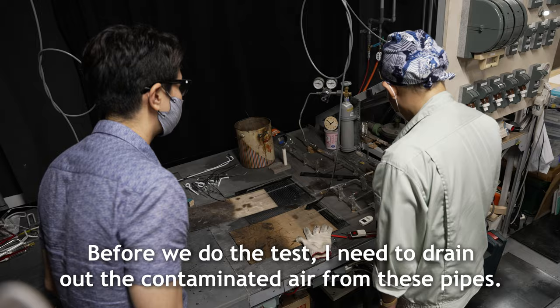This process is called bombarding and is crucial to ensure that the tube can emit light as intended, as well as ensuring a usable lifespan. A powerful charge of around 25,000 volts is passed through the tube to obliterate any dirt or impurities. This causes the tube to glow intensely, and as you can imagine, it gets pretty hot. The inside of this tube is currently reading at 177 degrees Celsius.